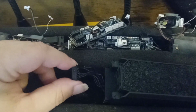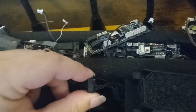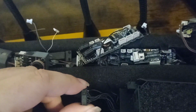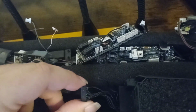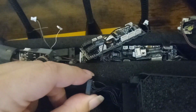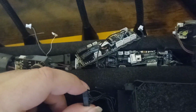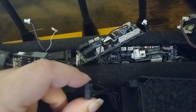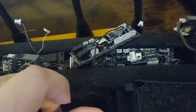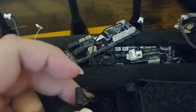First thing that I want to address before we get started, I'm going to open up the locomotive and rewire where the grounding wire is going to go. Since the only lighting function inside the locomotive is the headlight, I'm going to choose either pin 4 or pin 6 to be my new grounding wire. I don't want to hardwire the tether to the locomotive, as there's not enough gappage for the wires to go through the hole of where the plug would go in and not have an issue. So the simple, short-term fix is to just rewire where the ground for the headlight is going to go from the locomotive JST plug board through this cord and then through the decoder. So I'm going to resolder some of that, and I'm not going to really use this wire anymore, unfortunately.